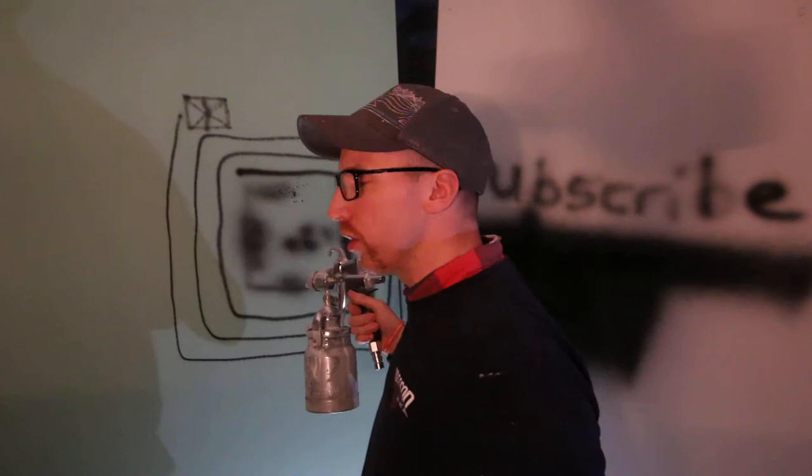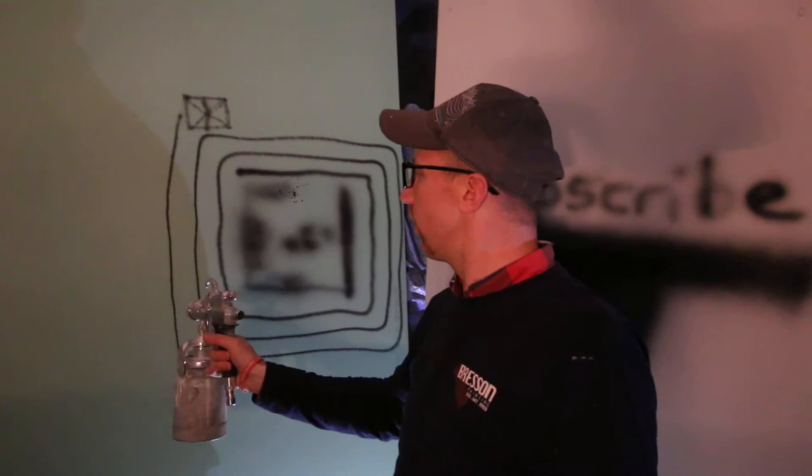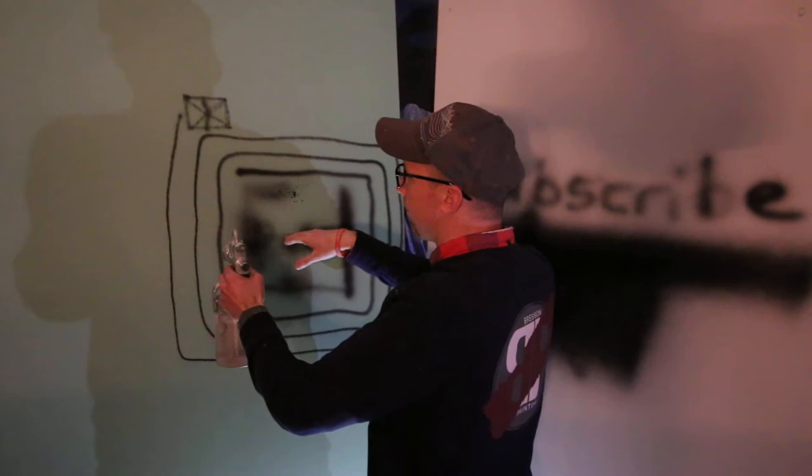With you guys is, you saw how close I got here on this. This is going to be very different if you've used an airless spray system. The HVLP is going to vary a lot. Instead of your 6 to 12 inches that you're used to with your airless system and fanning it out on the ends, with your HVLP you're going to want to keep working at a 90 degree angle, meaning that at the ends you don't want to fan it out. You want to just go straight out.